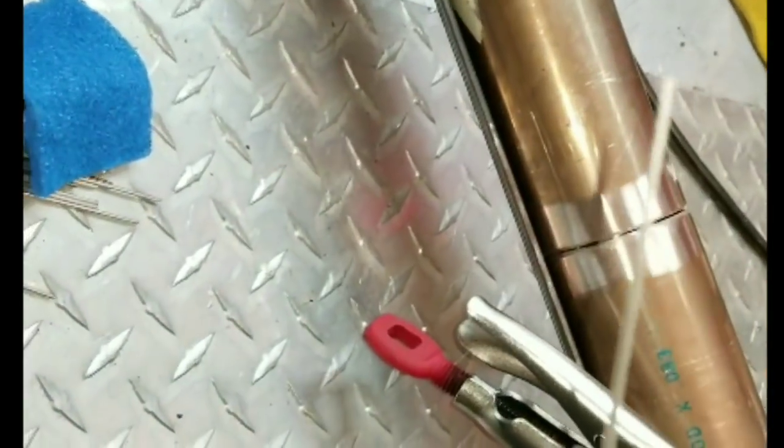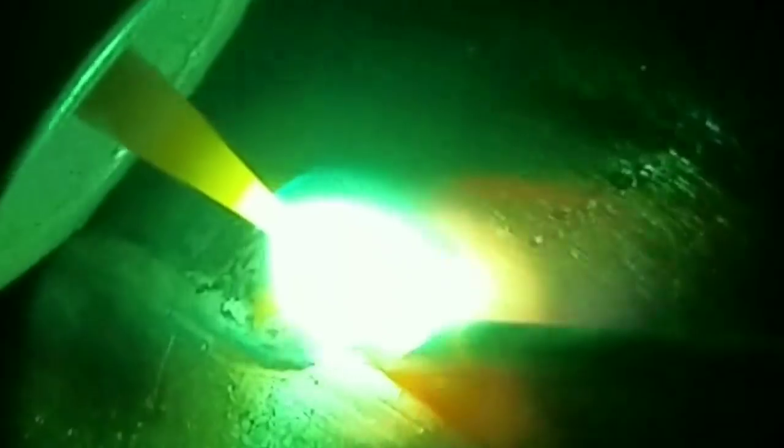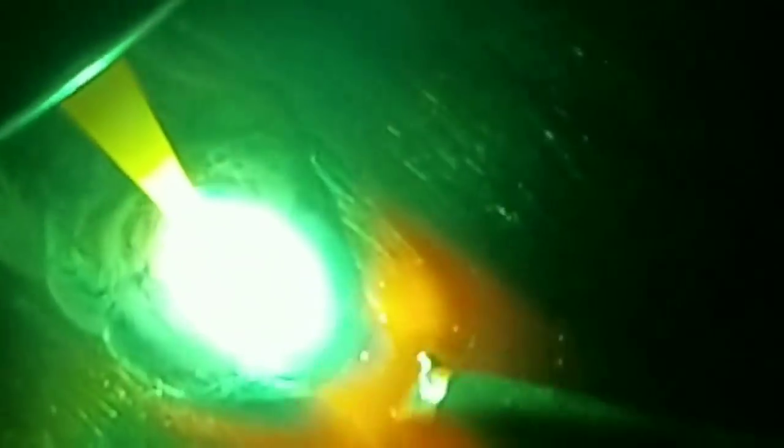Touching your hands to it — the oil from your hands can cause contamination and a dirty weld; you'll see it floating in the top of the puddle as we're running the root and the tacks. It's got a real dead puddle. As soon as it starts, you'll see the edges wet out and then that's it — that's all you're gonna see. Then you'll see it start to sink down, and that's when you start adding just a little bit of wire. We had amps set at about 80 with a Miller thumb rheostat to control your amps. As soon as we get up to about 75 we'll go 100% on 80 amps.